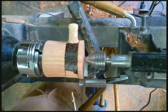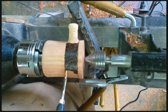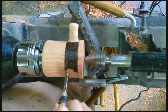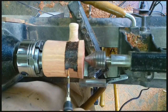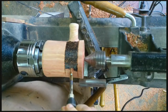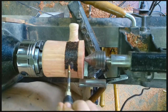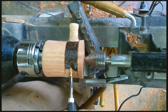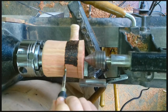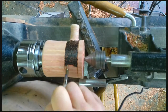Yeah, I use Hut products, Doug. I have had some spectacular failures with CA, both CA gluing the pen to the tube and CA finish. But I really like the Hut Perfect Pen Polish System, which is a wax and shellac base. And then I usually go over the top of it with Hut Crystal Coat, which is microcrystalline wax and shellac.